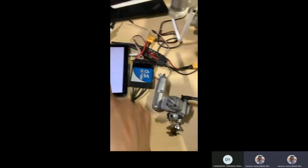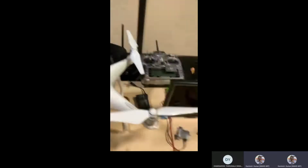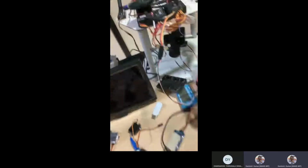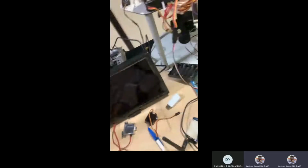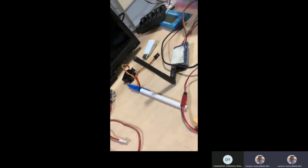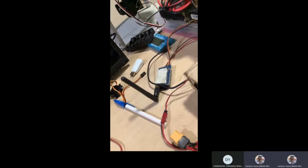Okay. So if you want to visualize your information, you can go ahead with a mobile-based telemetry or maybe an RX to receive the signal. You have that also. Another type is the monitor. If you want to display on the monitor, either you physically connect the camera directly to the HDMI port, or you use a Wi-Fi connection, or a long range telemetry communication system. Smart TVs also capture directly with the internet protocol. So Wi-Fi as well as the internet you can use for receiving the data. Lots of options are there for the pilot.